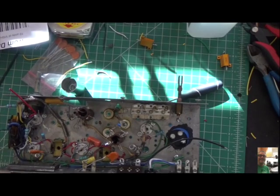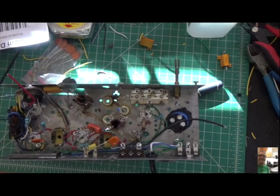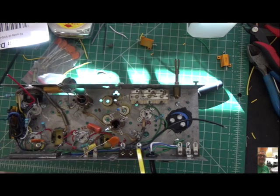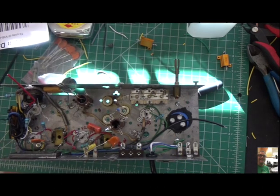Okay, let me give you an update here. In the previous segment I made a mistake - I told you I was going to test the resistors and see which ones are right. Completely wrong. I have to have the whole radio built before I can do that - I have to have my B+, everything drawing on the current before I can figure out the right resistance. What I'm going to do for this power resistor is use a decade box - a power decade box - which I'll show you in an upcoming video when I get to that point.